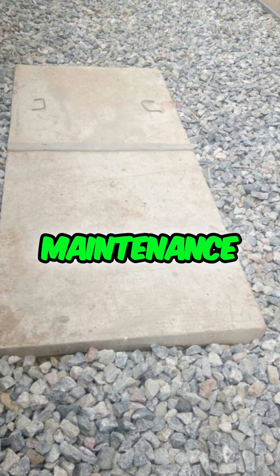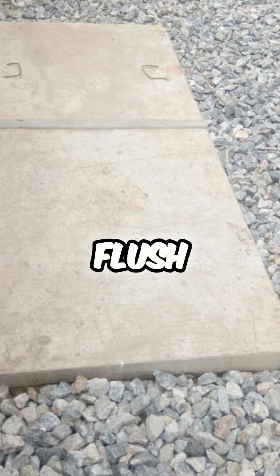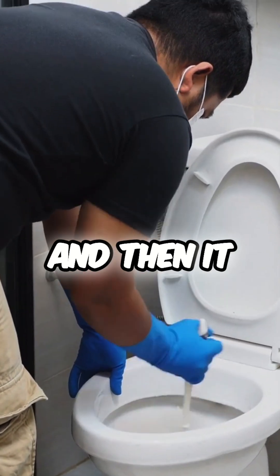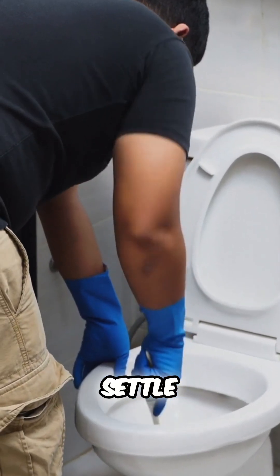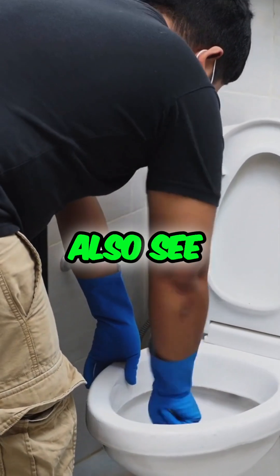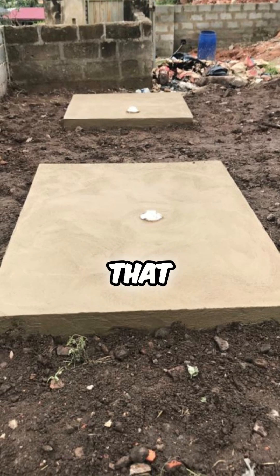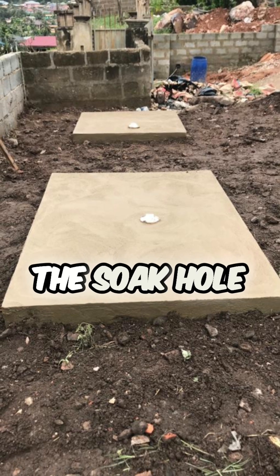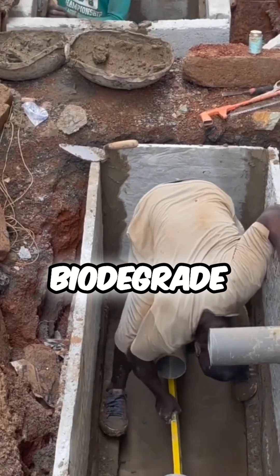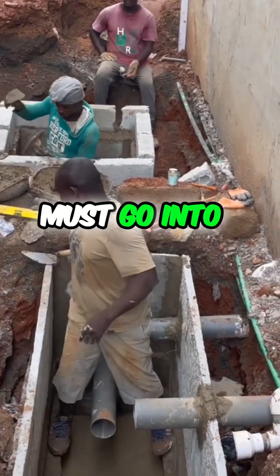What are the steps we take when it comes to maintenance? First thing, if you get to realize your digester is getting full, it usually happens when you flush the WC and you notice bubbles, and then it takes time before it settles into the digester tank. There are also occasions where you might see water outside around the tank showing that it's overflowing. In that case, maintenance has to be done — either the soak away or the soak hole pit is not working well, or materials that cannot biodegrade have gone to block the pores or the pipes, clogging the way the water must flow into the soak away.